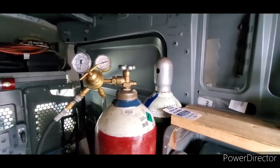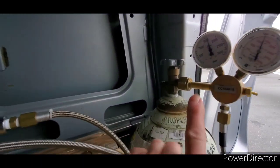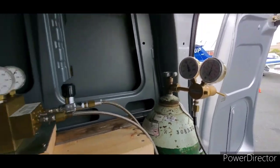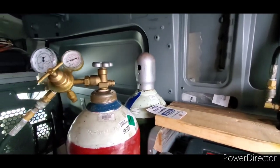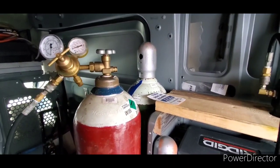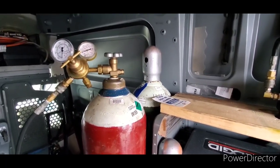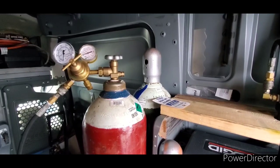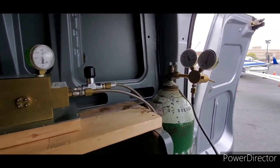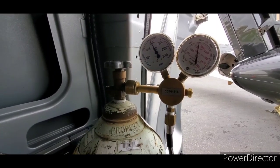Just the last thing to note: since this is a service truck and I go on highways and everywhere else, I always have to remove all of these regulators and put the safety cap back on the bottle before departing — to make sure that if this van is in an accident, these can't be busted off. If you've ever seen the aftermath, they go off like a rocket and will punch through concrete, cinder block walls, vehicles, buildings, people — anything in their way. On top of that, oxygen is an accelerant; it won't cause a fire, but if there is a spark, it will make it a very big one.